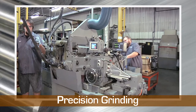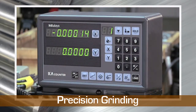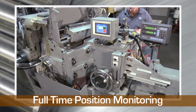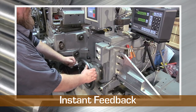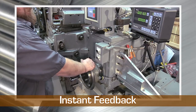Wisconsin Metal Tech takes the guesswork out of checking part sizes during in-feed, through-feed and bar grinding using a sophisticated glass linear scale. The scale is mounted on the grinding machine to monitor its position at all times. The scale measures the machine's position relative to the part. The digital readout gives the operator the ability to quickly and accurately compensate for wheel wear.